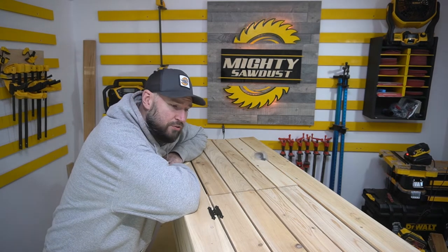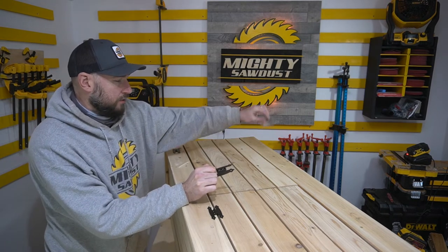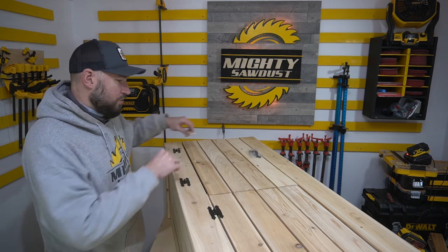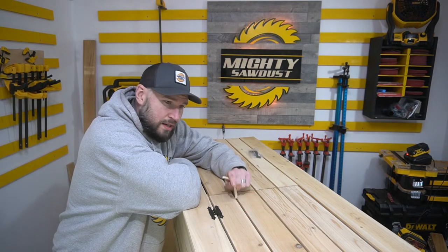We're at the final stretch of this last-minute build. She wanted it before Christmas, so the goal was to get it done as quickly as possible. The last part now is to get the hinges attached. I found these at Home Depot — they have that chest kind of feel to them. I also got a little handle for easy access when opening. I'm using the leftover quarter-inch scrap plywood to space the back so the two halves won't rub against each other, and I can get the spacing as even as possible.